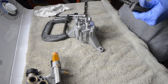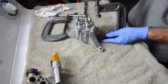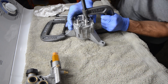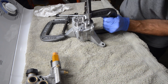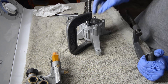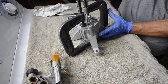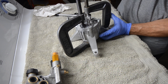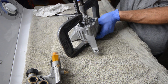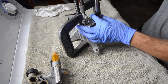I've got some four-inch C-clamps here. We'll wind them out, clamp it down, and pull this thing apart. Maybe I should have opened these before I started the video. Now this isn't going to sit very flat, but that'll be all right. Make sure you get on that little lip under there — doesn't have to be real tight. Don't scrape these; otherwise it'll tear the seal — the seals that they slide in — and you'll ruin your pump. So keep an eye out; try not to mess with those. Any machine surface you want to try to stay away from. I've got it down. Let's start pulling this apart.